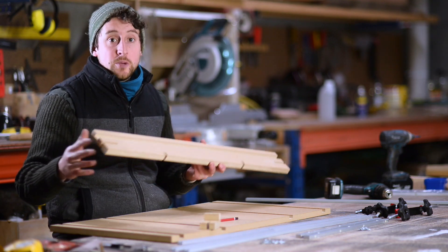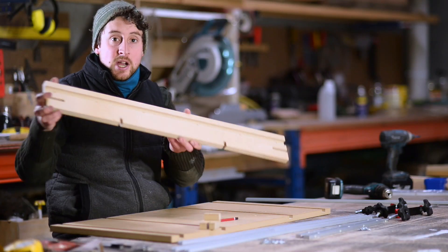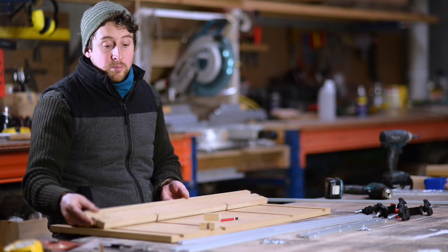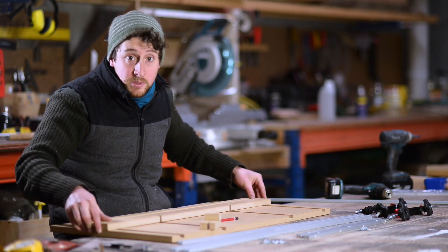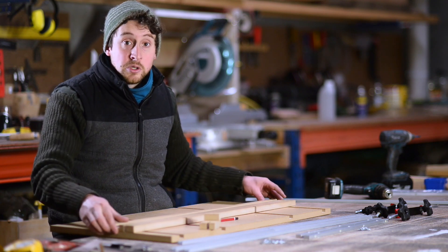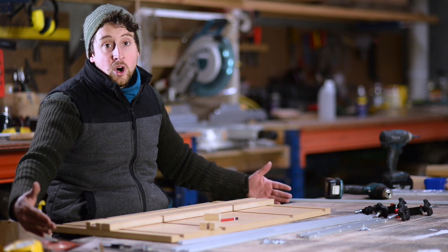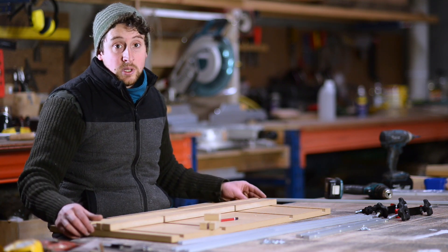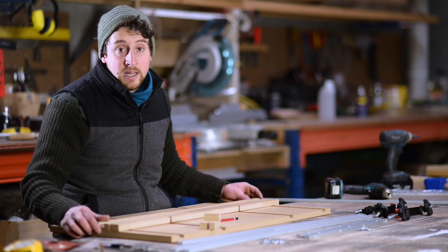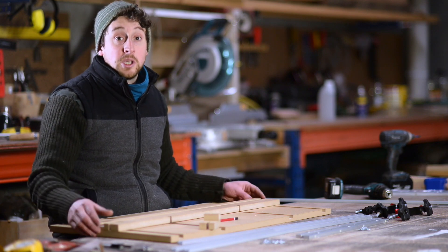You'll end up using two pieces of T-Track on the base and one full-length piece of T-Track in your fence — you will need to cut that down as well. My fence is 800 mils long because my whole jig is 800 mils long, so I ended up with a little piece of T-Track off cut that wasn't really useful. You might decide to make your whole board longer and that's okay, though any longer and it may get a bit unwieldy — design it in accordance with your table saw and the kind of work you do.